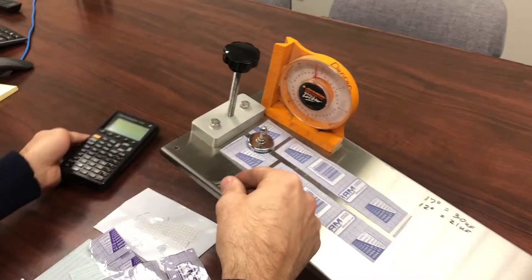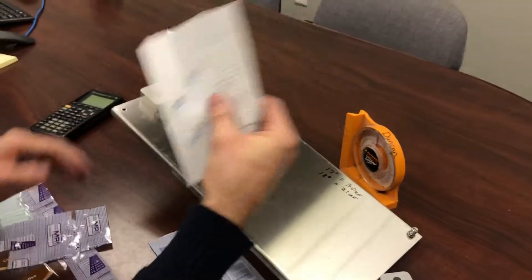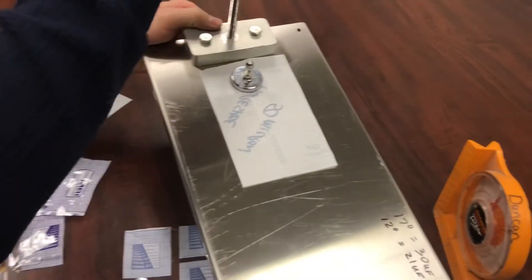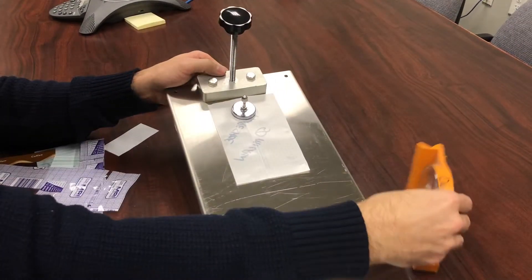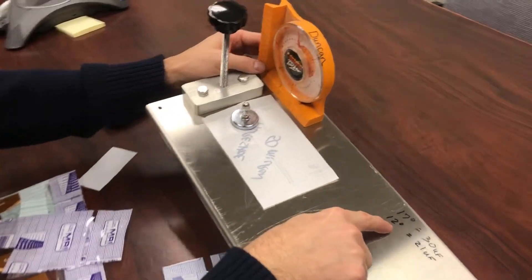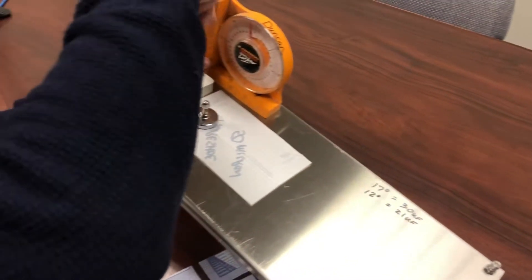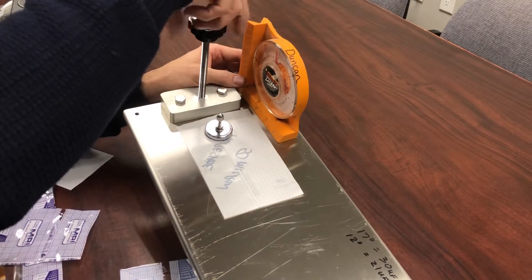So if we do the same thing with a good sleeve that I've already cut, I will lower this back down. Our standard is 20. I already know that if I put this at around 12 degrees, the tangent of 12 degrees is 0.21. So I will lower my table until my meter says around 12 degrees.